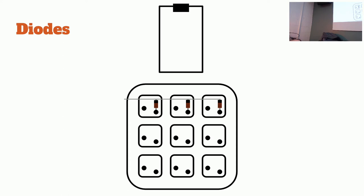Is anybody new to soldering and would like some tips? All right. So, first thing when you solder, and the first mistake every person makes, is you try and put the heat onto the solder. That's not how soldering works. What you should think of is soldering is flowing the solder. So you're going to apply the iron to where you want the solder to flow. You're going to heat up the actual wire, that little loop. So you put heat there, and then you touch the solder to the loop. And then as that flows in, you just gently push it in. It'll fill in and be easy to go.